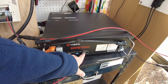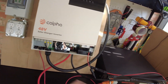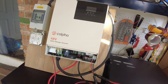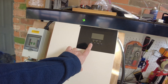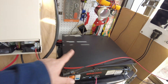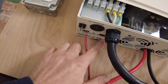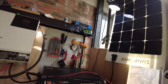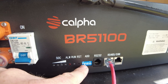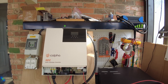Looking in the manual for the battery shows the pinout, and the inverter manual shows its pinout. You've got to build the cable to match up the pins — they're in different spots, but it is documented in the manual. They also do sell the cable. After I got the wire built properly, it still wasn't communicating. The inverter was set to Pylon protocol and this battery speaks PACE, so I changed it to PACE and then it did start communicating. Also note there are two RS-485 ports — you have to hook the battery up to port two. And I had to turn all the DIP switches off except for one to make it ID one. So a lot to figure out to get the communications going, but if you follow what I just described, it should work.